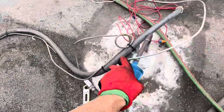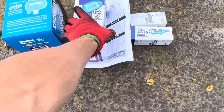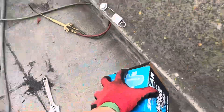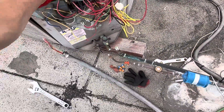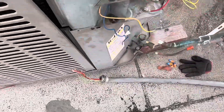We got a new filter — not using the factory piece of shit that came with it — so I've got a bigger filter dryer going on there. It's not an electrical burnout, it's mechanical. It's still running. We got our suction line here. We're going to get this up and running today. We're not worried about flushing out downstairs or changing an expansion valve — we'll figure those problems out.